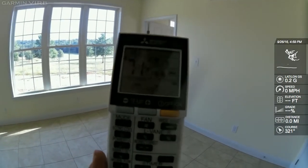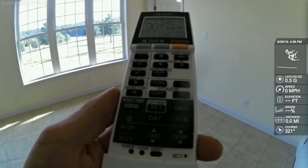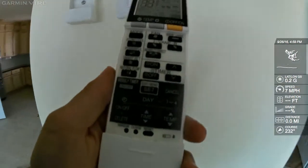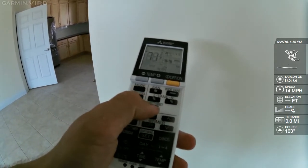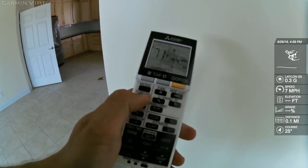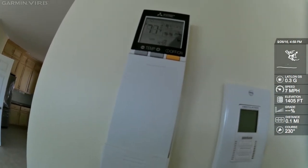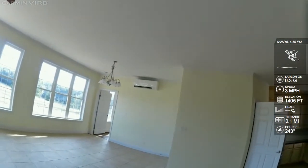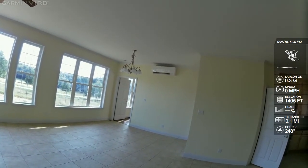This is the remote for the mini-split air conditioner. As you can see, it has a lot more buttons than the typical up, down, mode, and program buttons on a conventional HVAC thermostat. It allows them to do all kinds of features — different heating and cooling modes, and it can even follow wherever the remote is and blow air toward you. It's got econo-cool features, which is great for those early spring and fall times when it's too humid but you can't really run full air conditioning. A mini-split eliminates that problem by speeding and slowing the compressor to dehumidify the space without making it super cold.